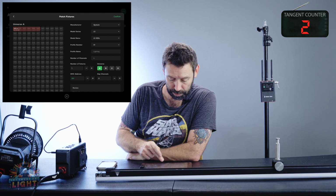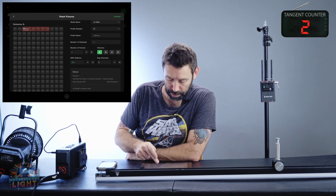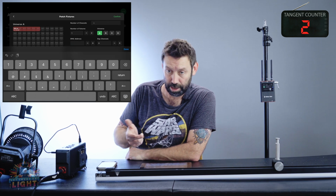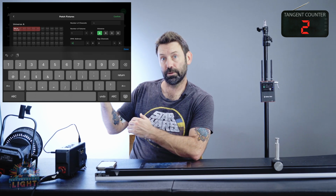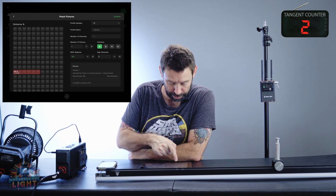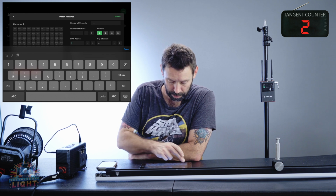I'm going to go back down to 1 because we just have 1. DMX address, you can choose. You can use the plus and minus, or you can just type in. Let's say in a lot of shows, maybe you want to give a little breathing room. Maybe you want to start at channel 100, let's say. Now you can see it's going to drop it to 100. Just for our purpose, I'm going to leave it as the default. We'll go back to 1.